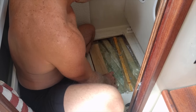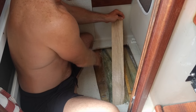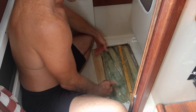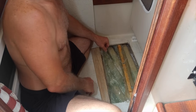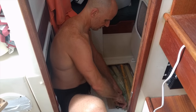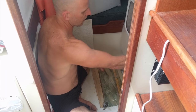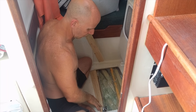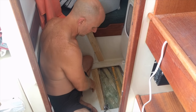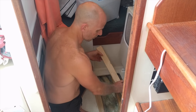First of all I'll add fiberglass to this piece here, and I'll add this piece over and then wrap it around so that it's all covered with fiberglass. Then I'm going to add some clamps to hold it all in place, and this will make sure that the plywood is close to the surface and that it sticks to the underneath of the surface, giving this piece more support when it sits on top of it.